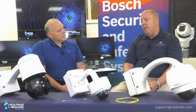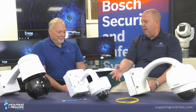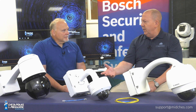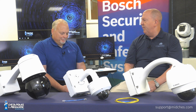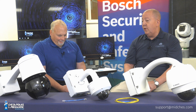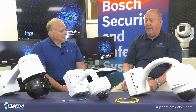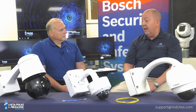Some people prefer to put the conversion from fiber to copper at the bottom of the pole or at a location that's more convenient to get to, then run a short jumper to the camera from that box. But a lot more people want the fiber optic media converter as close to or in fact inside the camera if at all possible. And that's why we're doing this video series — to talk about what options we have to be able to do that.